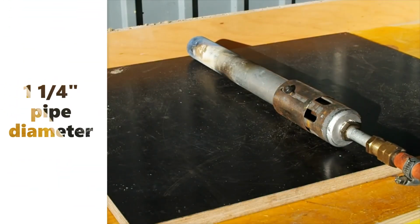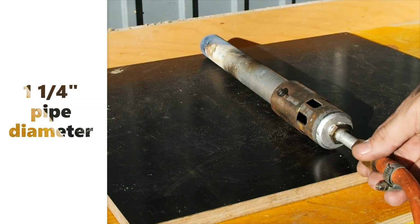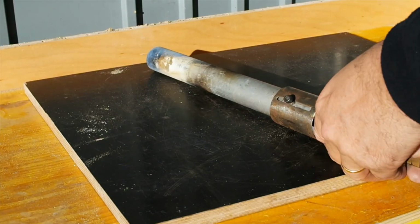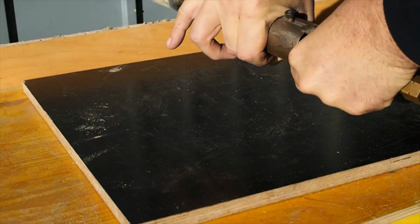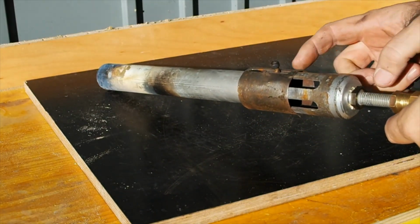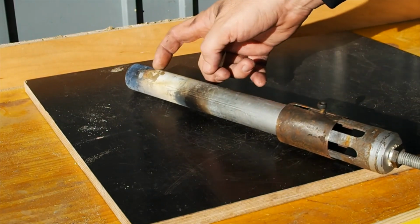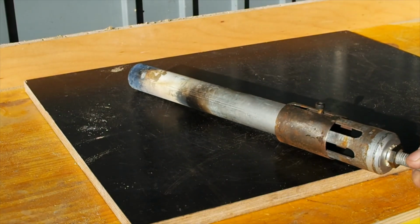So next up is a bigger Bunsen burner. This one's sort of roughly copied off a design I saw on the internet. You can see it's got a rather stiff air valve. But once again, there's a MIG jet in there, and you can adjust how deep in the jet is to optimize it. Don't have a flare on this because I only ever use it in the furnace. This one's used for preheating.